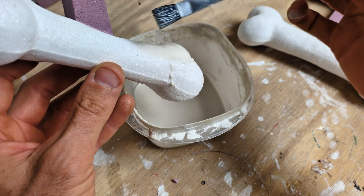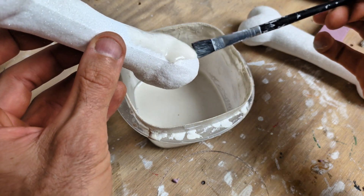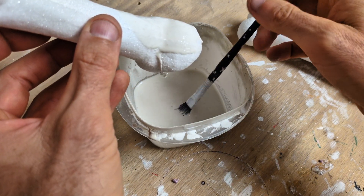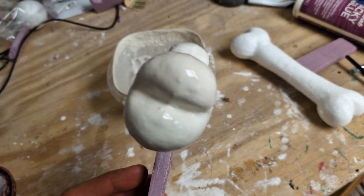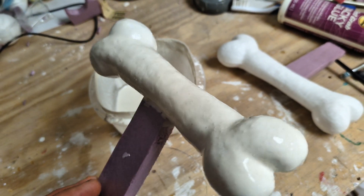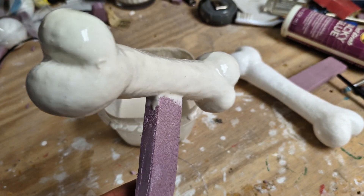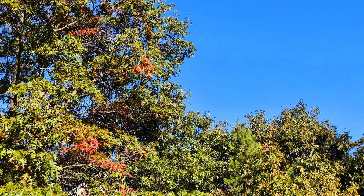You want to completely cover the entire piece of foam. The sprue does not need to be coated because we are going to be cutting off the sprue once it's all cast in solid metal. After the entire piece has been coated, we are going to let that set for 24 to 48 hours to completely dry. Once it's dry, it is then ready to be cast in solid metal.